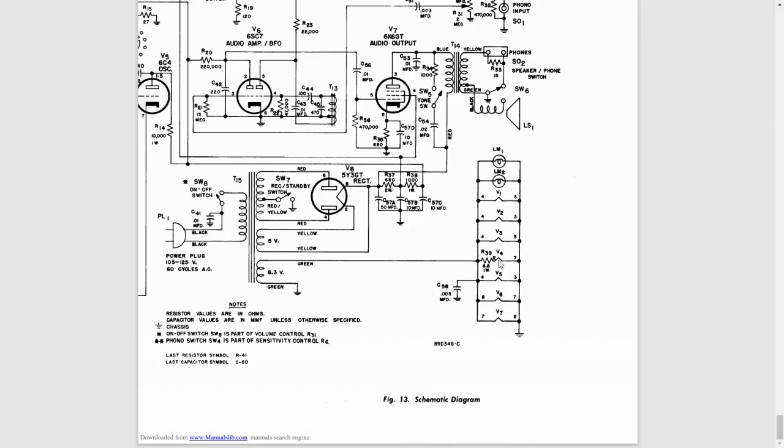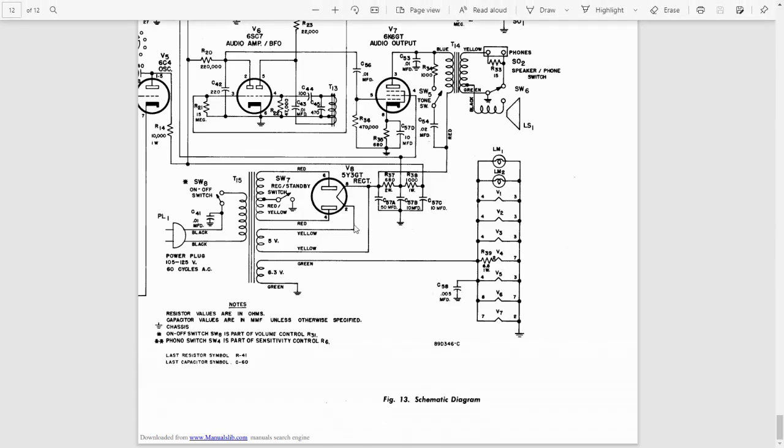The reason for this is that at the early stages, a little bit of hum gets amplified and comes out screaming from the speaker, so you really need highly filtered DC for the front end of the radio - not so much for the back end. I think it's safe to say many of these radios hum so low you could never hear it. Notice this resistor here on V4 - they've labeled the tube type punched right on the chassis, like 6H6, but didn't label the tube number.